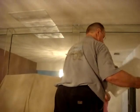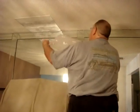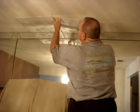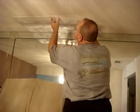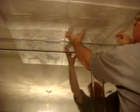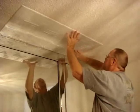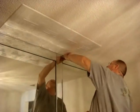As you place each tile in the ceiling, make sure they're lined up exactly with the one next to it. A small error will continue to grow every time you install a tile. If they're off a little, you can move them into place with a little push. Don't try to peel the tile off the ceiling to replace it, as the foam can easily break.